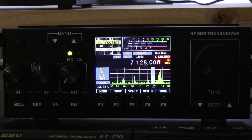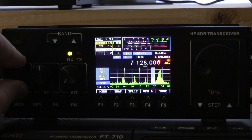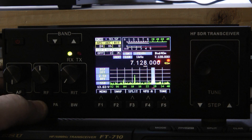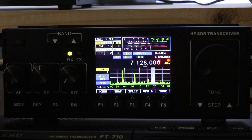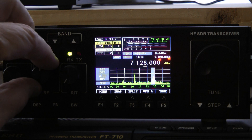This is the little 918 on sideband — it's a great sideband radio with a great receiver. Again, I'm very surprised at how good the little speaker off the back of this sounds. Let's listen in to a sideband QSO. You can use the DSP button to turn noise reduction on, and to change your various levels of noise reduction you turn the RF knob. You can go through the DSP features by pressing the DSP knob, and finally turn the DSP back off.